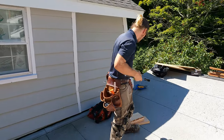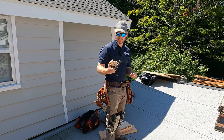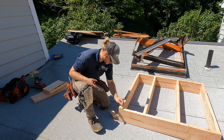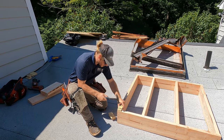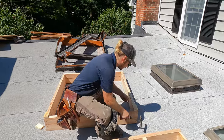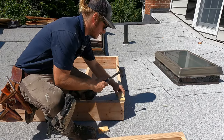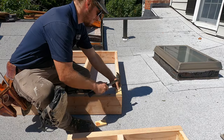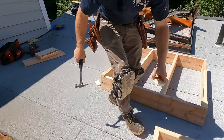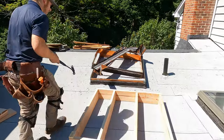This is where the roofing nails come into play — roofing nails and blocks of wood. A block of wood goes right here in the corner. I'm mounting these little blocks in the corner so I get proper spacing for our plywood — I don't want to mount the box too high or too low, and I don't want to have to measure while holding something heavy. So we just line this up with the top of the plywood right here and we're good. It's called thinking ahead.